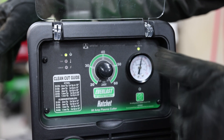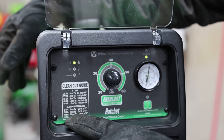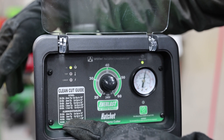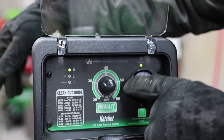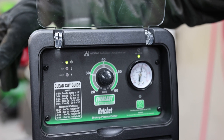I got some quarter inch steel, some three-eighths steel, and some three-eighths aluminum. I want to fire off a three-eighths aluminum — that's always a difficult piece to cut. For three-eighths aluminum, it recommends a one millimeter tip, which is included. It says run anywhere from 40 to 50 amps. I'm going to set it for 50 amps because I like running on the high side of things. Let's go ahead and see if it'll cut.